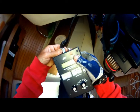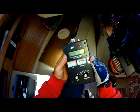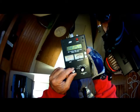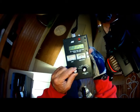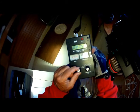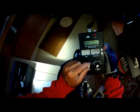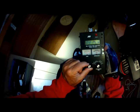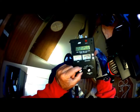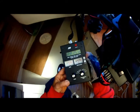Get the power, go to the right frequency. Here we're showing again right in the middle of the band — it is pretty much all the way under 1.5 through the marine band, and right in the middle of the band it's 1.1. That is how we test our antennas.